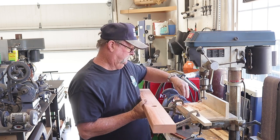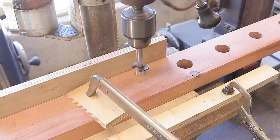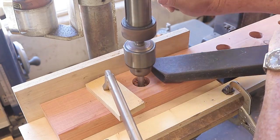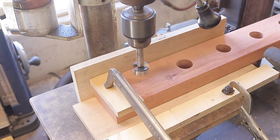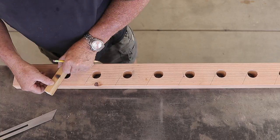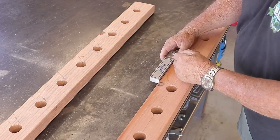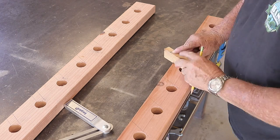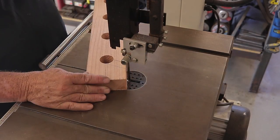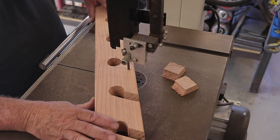That didn't quite turn out like I hoped, but I managed to get all the holes drilled with very little tear-out and it worked out pretty good. Once all the holes were drilled, it was time to lay out the little angle I needed to cut. I'm not sure of the exact angle — I just created it using a piece of 3/4-inch wood stock to create an even 3/4-inch gap. Then I took everything over to the bandsaw and cut it all out. The idea is that when the rack is hanging, the hat goes in there and won't fall out.